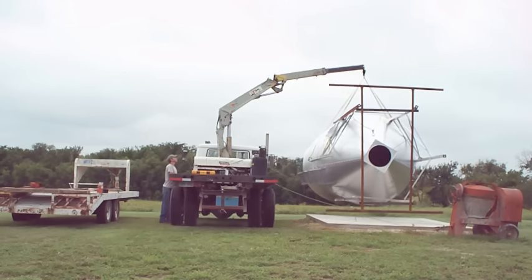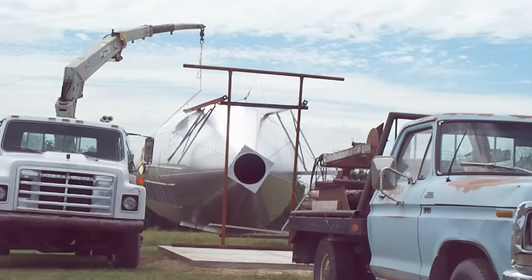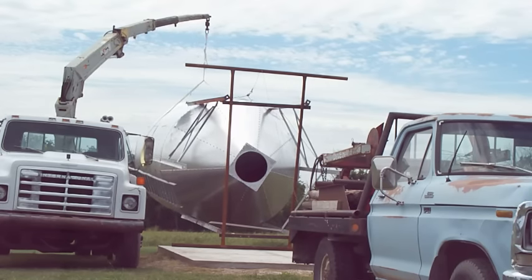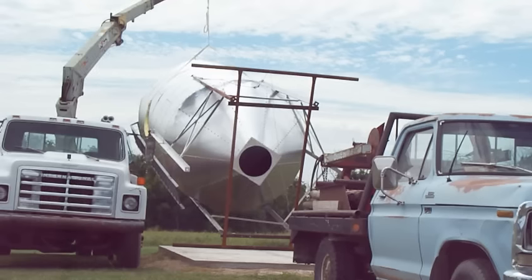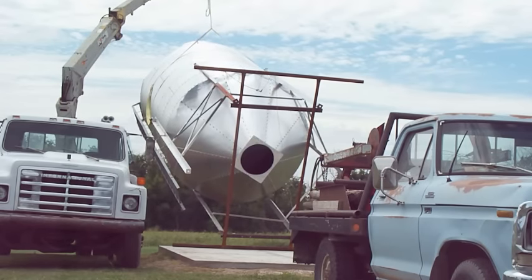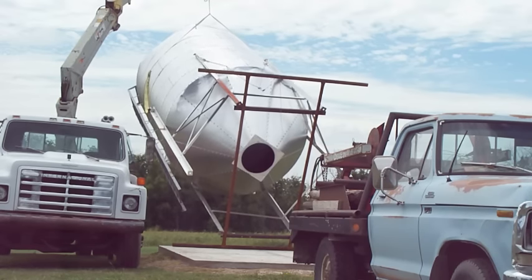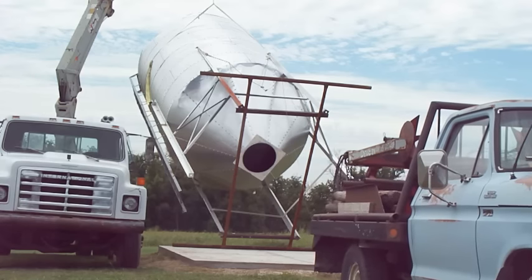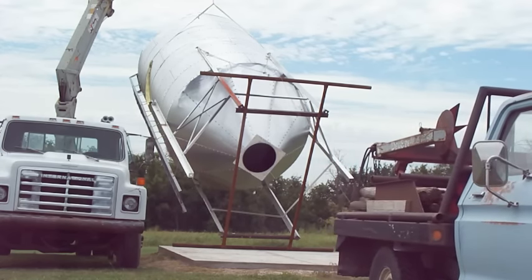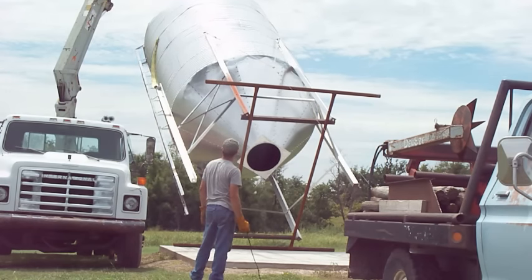I got a tagline tied to the base so I can pull it right into place. I decided to lift with the crane until it was up quite a ways, just to get a feel for the stress on the crane arm and make sure it wasn't overloading anything. On the back of this pickup I have a winch. I'm moving the pickup forward until the winch line is tight, and I'll use both of them together — that way there's no side forces on the crane.